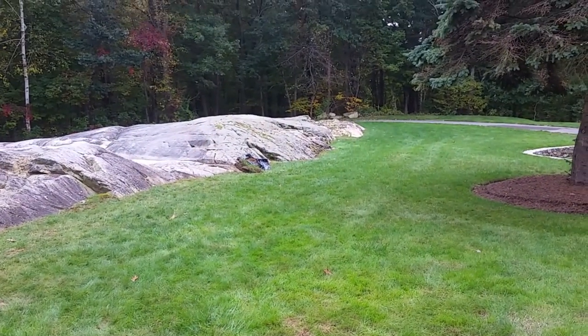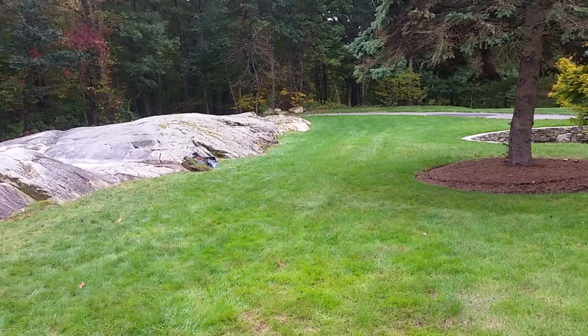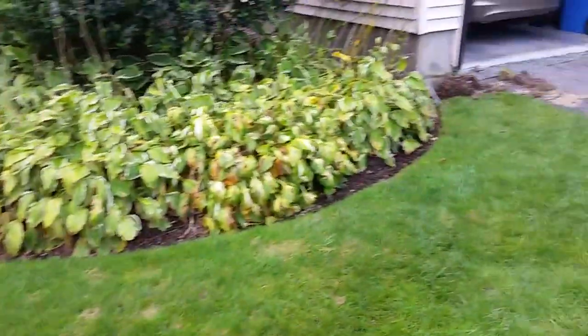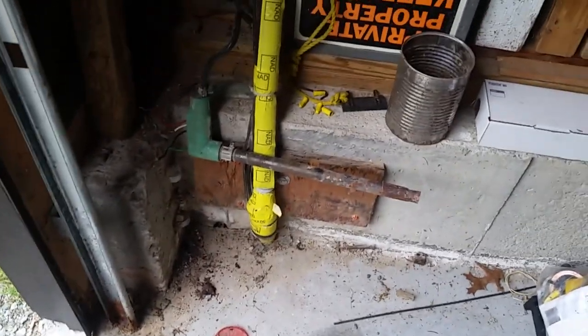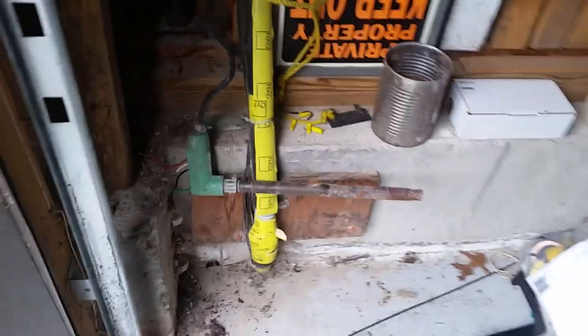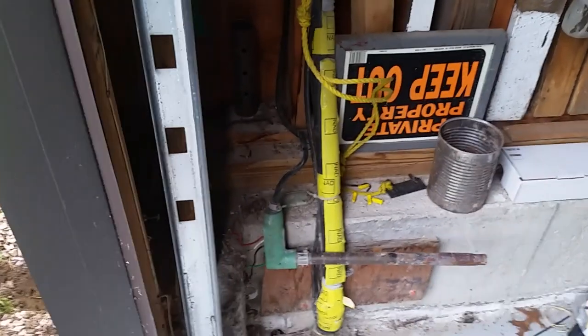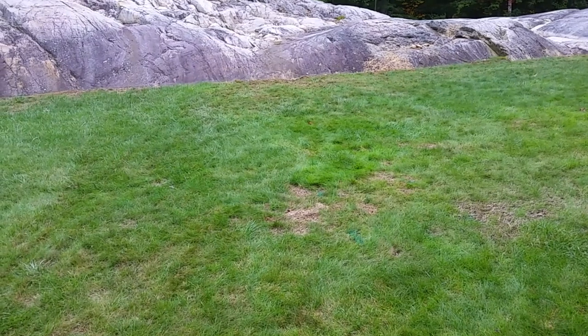And that was with my transmitter sitting over there above ground, hooked up to, no, I take that back. I could not get these signals with the transmitter sitting right there with all that cable. I ended up moving the transmitter, and you can see the cable outside now, but I had left that cable in this piece of conduit, which was vertical in the clamps, and hooked the transmitter up here. Well, of course, now the transmitter's sitting right on the ledge. Probably would have helped to shield it somewhat. But the fact of the matter is that it really gave me a good indication of where the cable went.